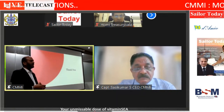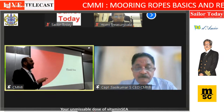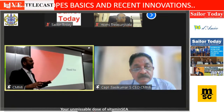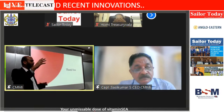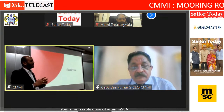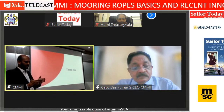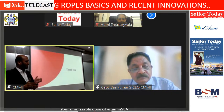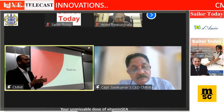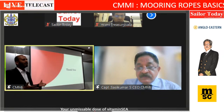Just to give you an example, I use a 64 millimeter polyester and then combine it with 60 millimeter of X2 ropes, or vice versa, because my entire vessel had 60 millimeter of X2 ropes. I went to some odd port and I used a 64 millimeter of a polyester, right? So the elongation differences may cause an issue. At some places, the ropes used are regular polysteel types, and some of the ropes are mixed fiber ropes, polyester and polypropylene mixed together, right? The elongation characteristics will be totally different, and it could cause an issue.